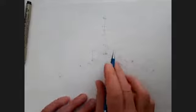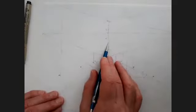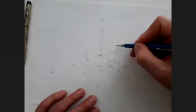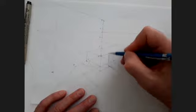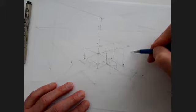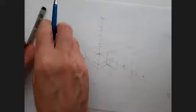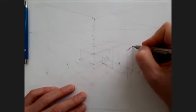I got to go 3 feet on this, so I'm coming up here to my 3, away from vanishing point left, because the floor comes away from vanishing point left. So everything on the right wall relates to left vanishing point and vertical. So that cabinet's actually going to come up this high. Each time I turn a corner, I switch my vanishing point. So I'm going to jump to pen now, since I know this is where I'm going to have that vanity set.